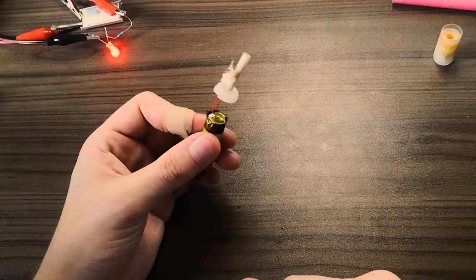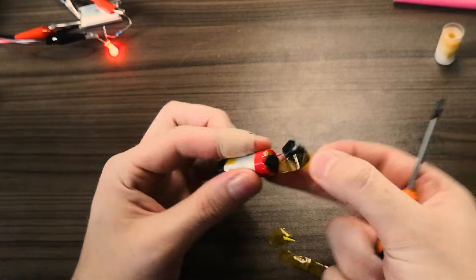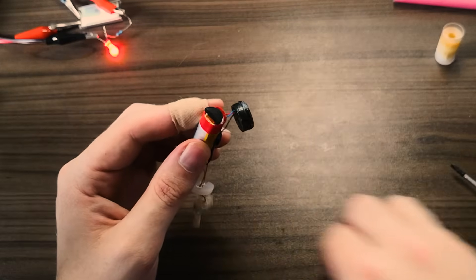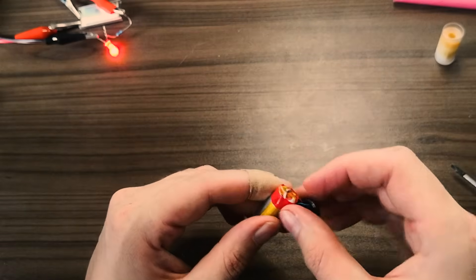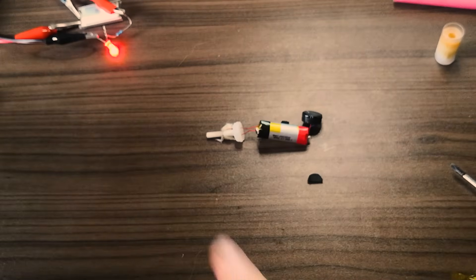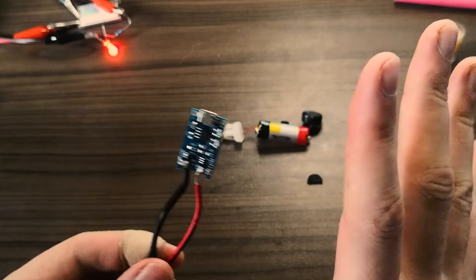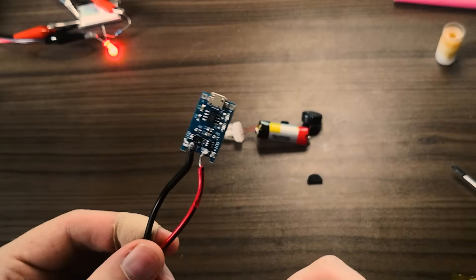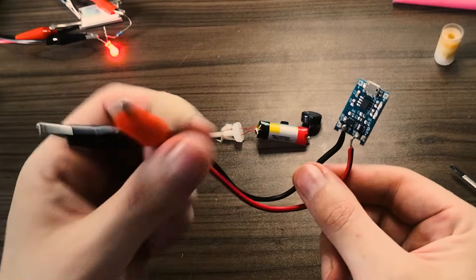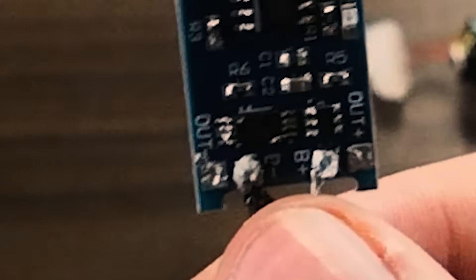Because I'm in a bit of a rush here, I'm going to quickly cut through the tape to expose the battery terminal, but in your case I would suggest peeling it off completely. There we go — safely exposed. Once again, this stuff is one use; we're going to dispose of it in the waste. We remove this little rubber pad, and there's our other battery terminal already sticking up and exposed. Now to actually charge the thing. In order to do that, we're going to have to use a little charging circuit. Here's the circuit I found on eBay — again this will be linked in the description below. It's very simple, and I'm not a professional solderer; I'm completely self-taught. So this is a very bad job and I'm not going to show you how to do that. If you want to learn how to solder wires onto a circuit board, go watch someone who knows what they're doing. It's currently connected to a pair of alligator clips, negative to negative, positive to positive. You want to solder to the B-plus and B-negative terminals — that's battery negative, battery positive — and your power comes in through a little micro USB.